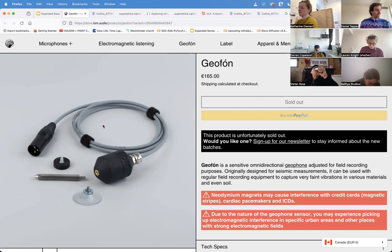So you could actually build this pretty much using the techniques that we've used today. It's just that sourcing the components is a lot more expensive than what we've been working with. Like I think the component itself is about $80. But essentially it's a capsule, and it's quite sensitive. So when it vibrates based on a large amount of seismic activity, then it creates a signal. And it performs really well under 1 kilohertz, so pretty low frequency, which I guess you'd expect for seismic stuff.